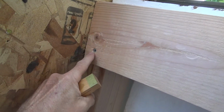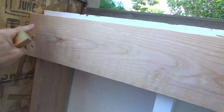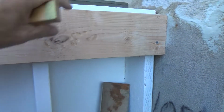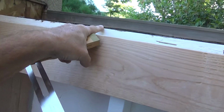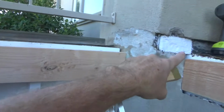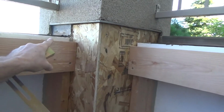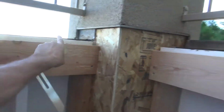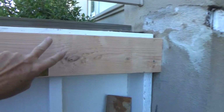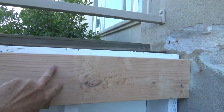I don't mind doing that. I only have 2 screws in it. I can undo the screw, tap that down, tap it up, whatever I have to do, because I don't know if their existing wall is exactly where it's supposed to be in relation to this wall and that wall. You follow me? So that's why I'm not going to nail this off. I'm not going to screw it off.